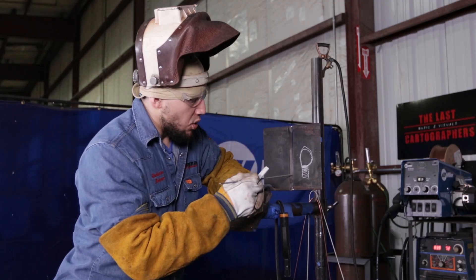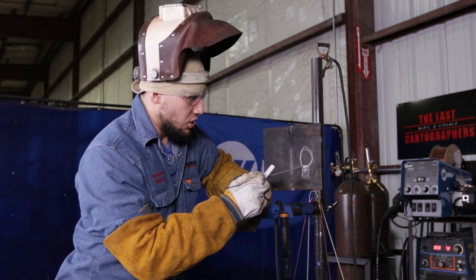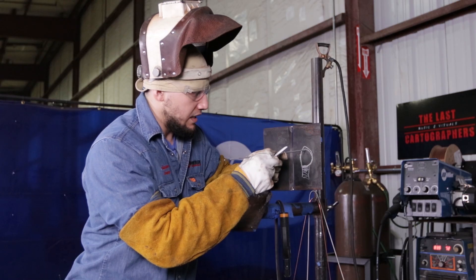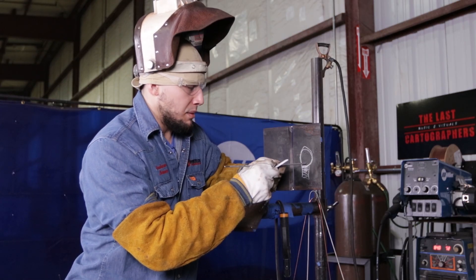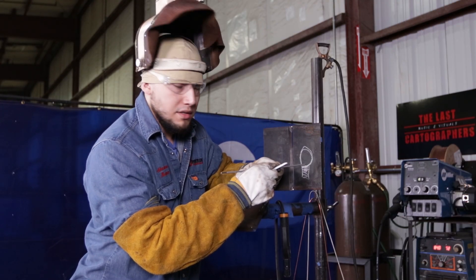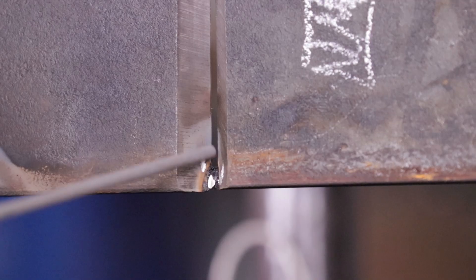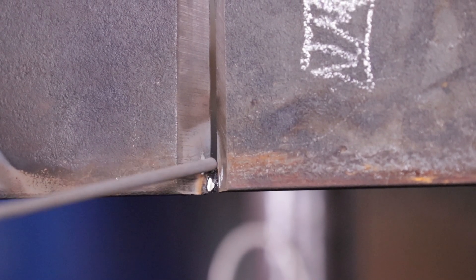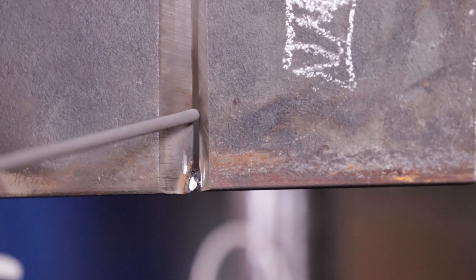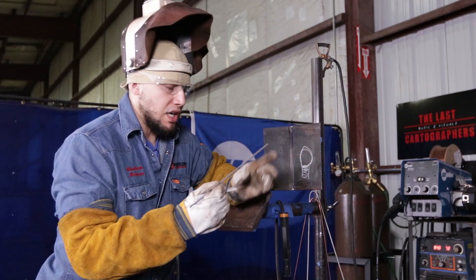Many people don't know how far to go up or go down. Your window is your keyhole — you don't want to go past the keyhole. You want to go right at the leading edge of that keyhole and go back down. And when you go down, all you do is go down to the edge of that puddle right here. So my puddle is going to be down here, and then I'm going to have my keyhole.